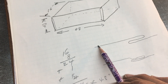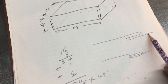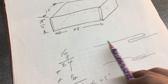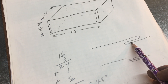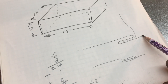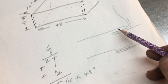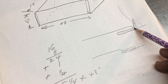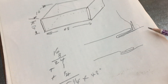The metal goes in flat, and by the time it comes out of the fifth roll it has taken up one inch of material and folded this little form. When the next piece of duct is inserted, the quarter inch goes into this groove, then the half of your duct goes over that way, and this tab is beaten over with a hammer to lock everything in place. This raw piece turns into a locked piece that locks the other half of the duct inside that groove — that's called a Pittsburgh lock.